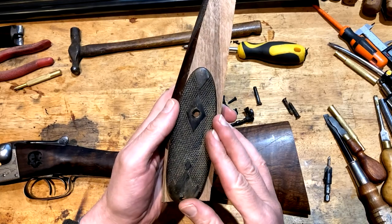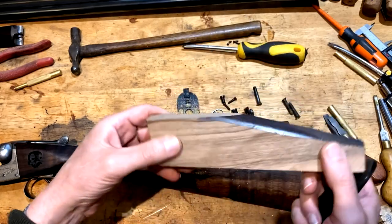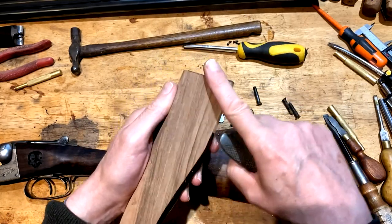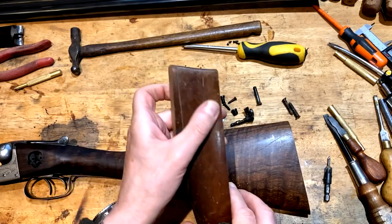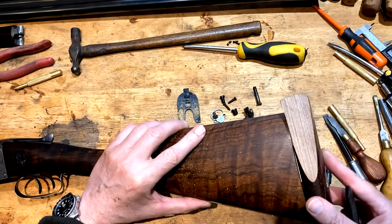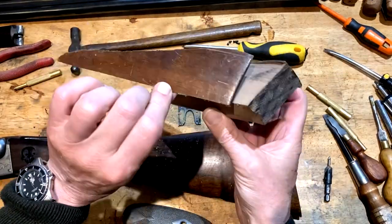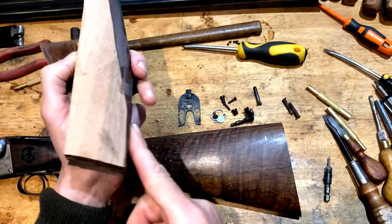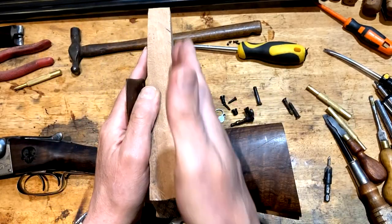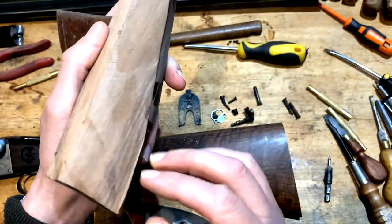There's enough wood in there to make a nice job. Cut that to length. Put this on a sanding belt, flatten it out perfectly. That end doesn't matter, side doesn't matter, it's only a reference. So we can plant it straight on there. Just to reassure you, I have cut that off freehand, balancing on that datum point on my bench. And you can see a very thin line where I put a pen line to follow it.